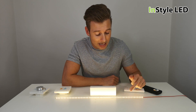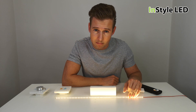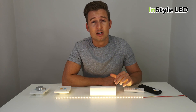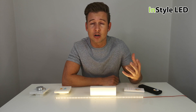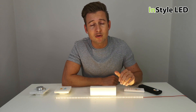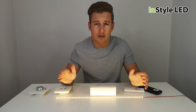All of these strips are available for next day delivery. We have the 24 watts per meter type and also a 12 watts per meter type. The 24 watts type is more for a working light for an area with high ambient lighting such as a shop front, hotels, or restaurants, whereas the 12 watts per meter is ideal for plinth lighting and covings just to give you a halo glow.